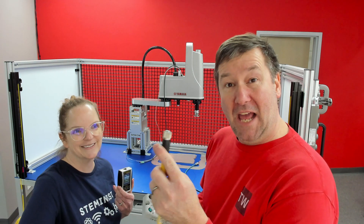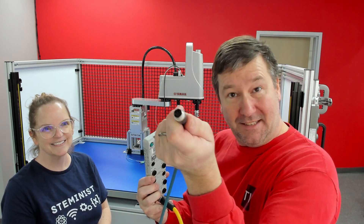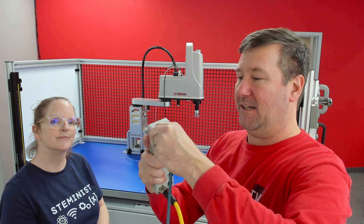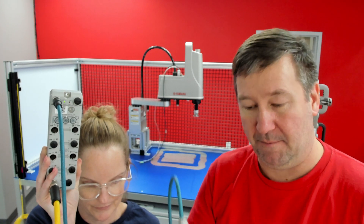We're going to need two cables for this. We have our power cable, which will go into the power connector, and we'll have an ethernet cable — this is a round-looking plug, but it is ethernet. We'll plug it in. Then we're going to connect the brown wire to plus 24 volt of the power cable, and the blue wire to the minus.